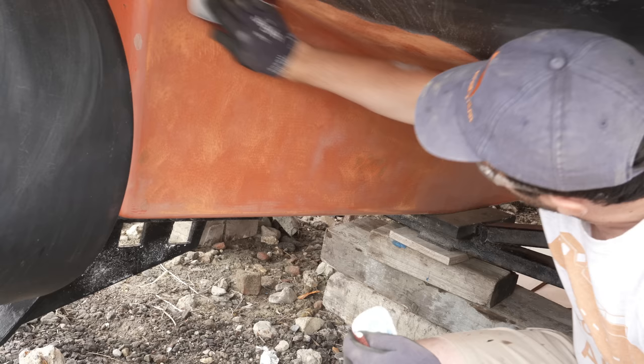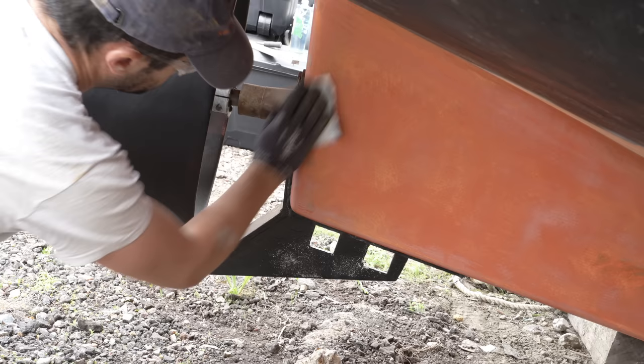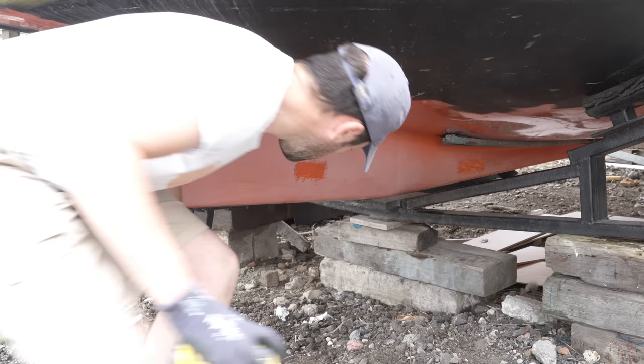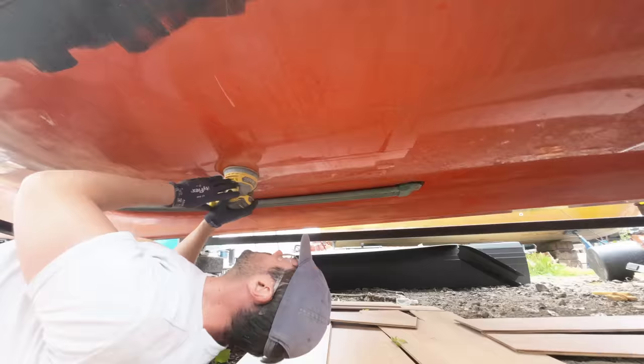Most of it hard to access, and much of it above head height. I did the tricky bits with emery cloth, and then deployed the hand sander, which I specifically bought with the lighter weight smaller battery for prolonged overhead work like this. I'm not going back all the way to the fiberglass, or to where the gel coat is paper thin, just far enough so that the shiny waxiness is totally gone. Epoxy paint will bond nicely to gel coat.